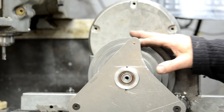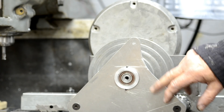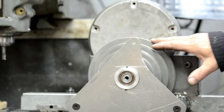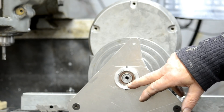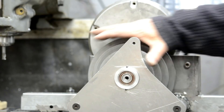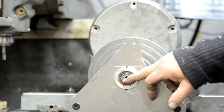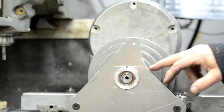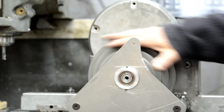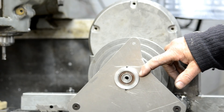The drive mechanism is now all totally assembled. The bearing bracket that we saw being made earlier has got the bearing fitted and is bolted on over the shaft for the pulleys. The efforts of ensuring that this was concentric seem to have paid off, because as you can see it spins pretty freely — which it wouldn't do unless the two bearings at each end of the shaft were concentric. Bear in mind that this is driving a 25 to 1 gearbox, so most of that friction is actually in the gearbox rather than in the drive system with the two bearings.